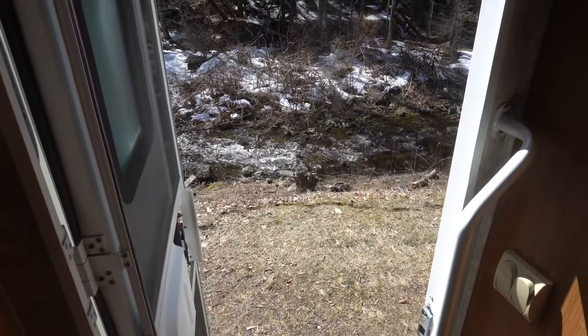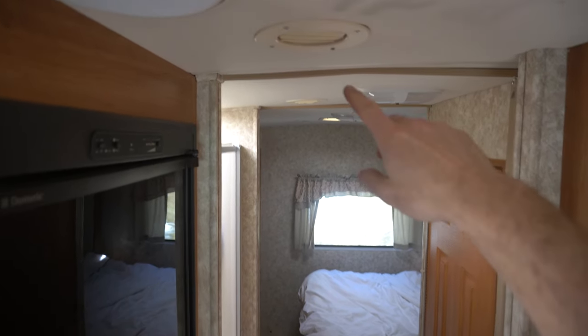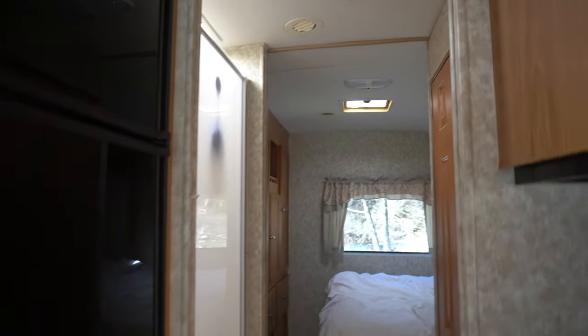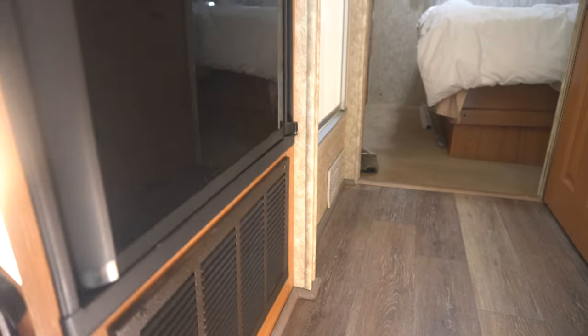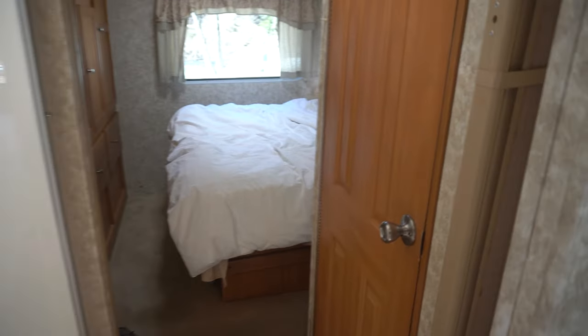You've got the various air conditioning vents in the ceiling up here — it's ducted and they run the length of the unit. And then on the floor, those are the heating ducts, with a couple more back that way. Heat rises and cold air falls — that is why they're located where they're located.